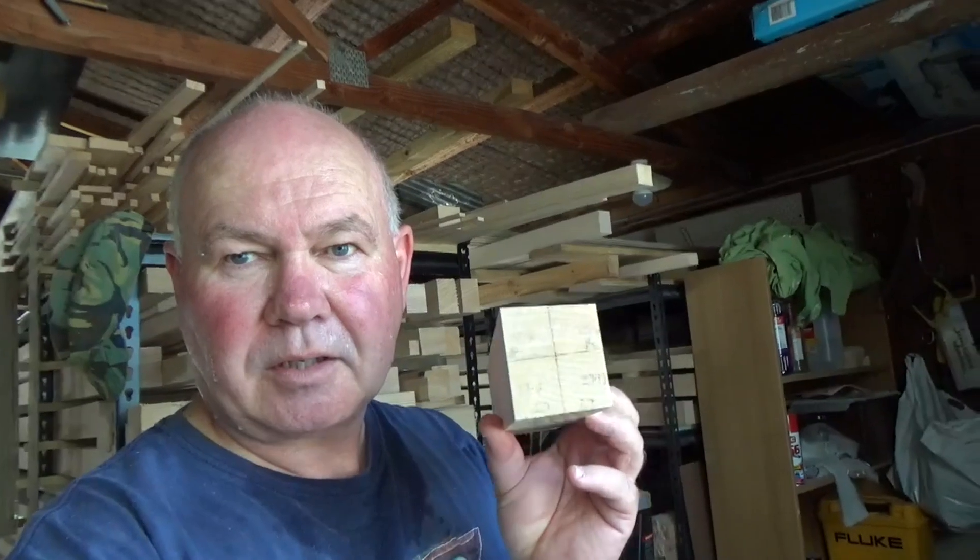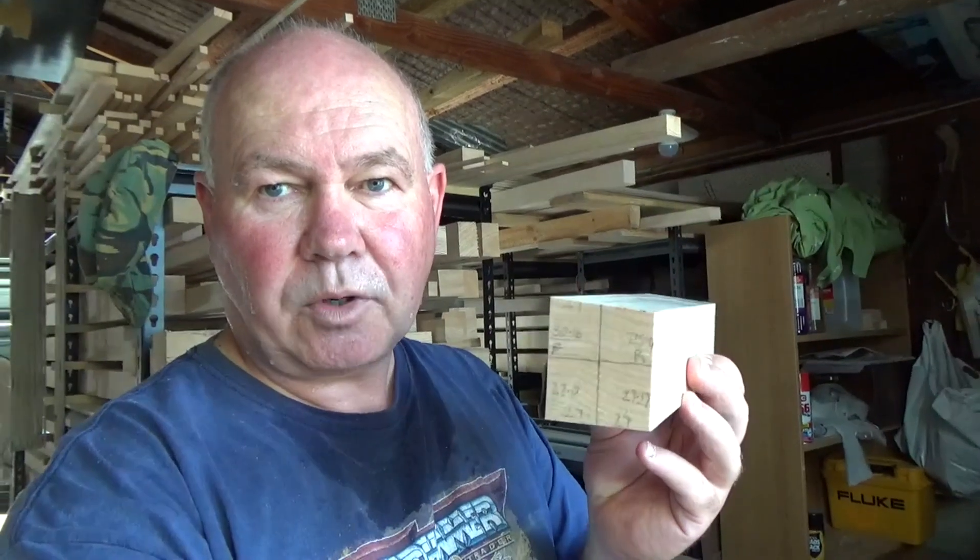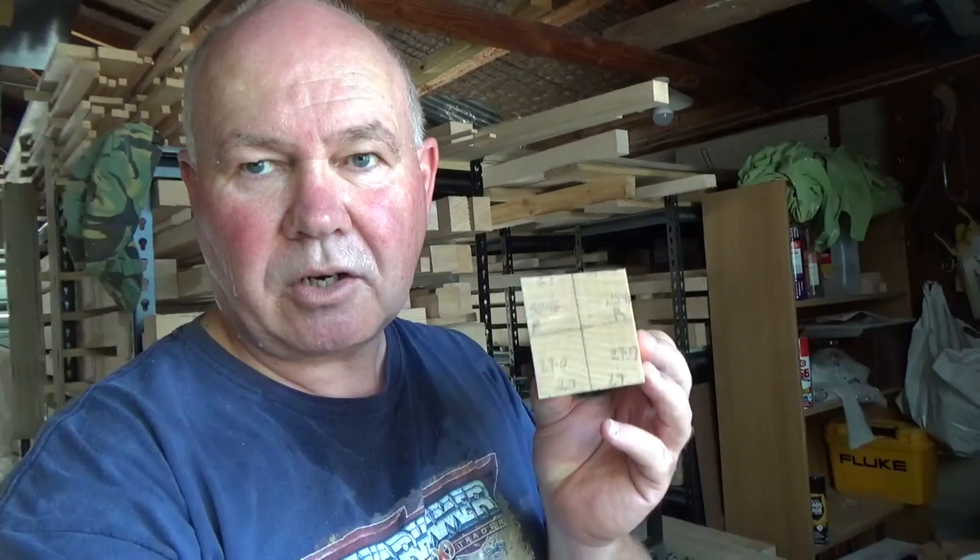It's still frickin' hot. This is where I've got to at the moment — the bottom edge needs planing. I've got to go and build a deck, unfortunately, so I've got to put this on hold for the rest of the afternoon; I'll probably get back to it tonight. What I've found is I had to plane the sides first. When I went back inside to check the dimensions, I figured out I need to plane the sides and get the parallel sides figured out first — then I get accurate measurements for the top and the bottom.